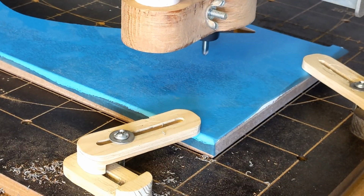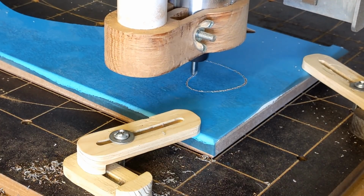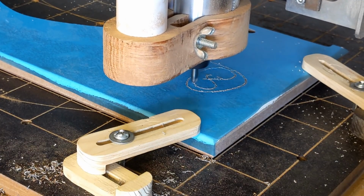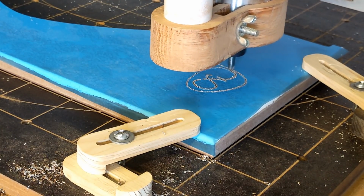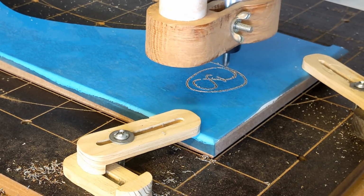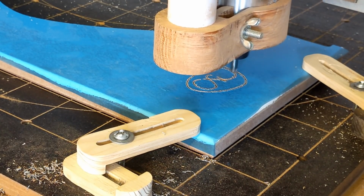And we've got the project on the Longmill CNC router now, and I'm using a scrap piece of wood from a job I did a couple days ago, and the wood is white. I painted it white, and you see there's this blue covering on it. Now that's masking. The masking is called ORAMASK 813, and it's the best stuff you can possibly use to mask off your projects. The reason is now I'll be able to paint the signature without worrying about the underlying color. There's links down below for all this stuff. I totally recommend the ORAMASK. It's like the best stuff for this.